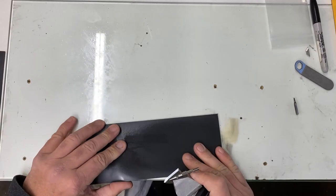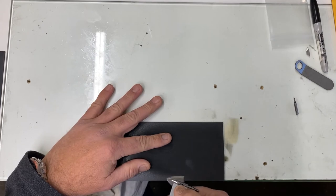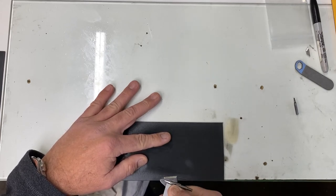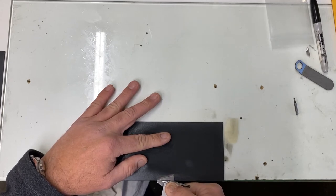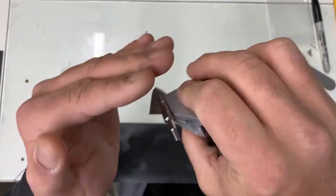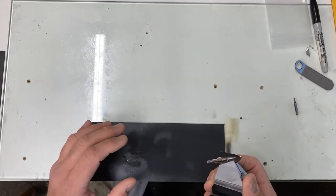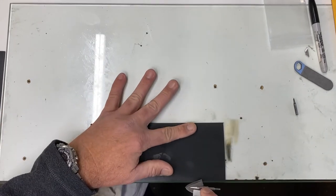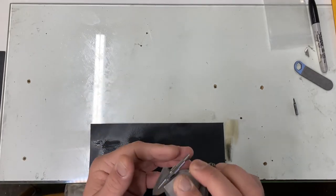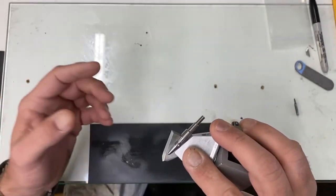The oil is kind of deceiving, but I've gotten this to where I'm comfortable — the marks are not there anymore with 1500. Now, this is critical on single bevel: I'm going to move my glass to the edge, put the paper right here, take the flat side of the blade, lay it flat — not at an angle — and pull it off. What we're doing is taking the burr off the back. Never lay it down on the flat bevel side at an angle — you'll never get it sharp. Pull it off a few times, and now I can feel the roll or burr on both sides.